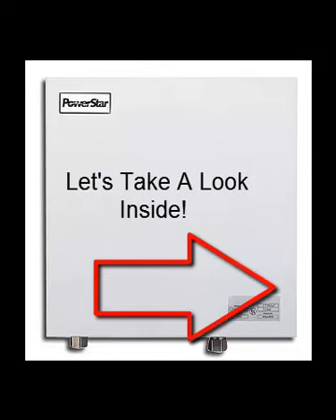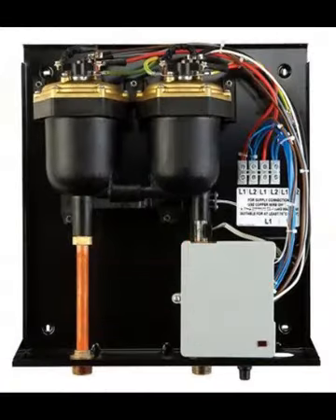It's very well constructed and has a different look about it. This is an electronic heat exchanger. Water comes into the inlet side, travels up through the first heat exchanger, is warmed considerably, and then moves over to the secondary. Then it works its way down and out to your home or the point of use where you need hot water.